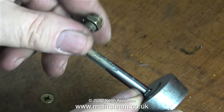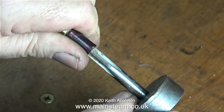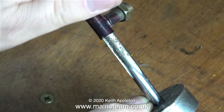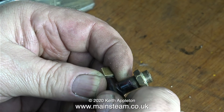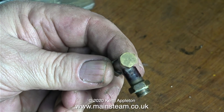This clip is out of sequence. Before I drop the parts into the cellulose thinners in the tub, I've re-threaded the top fitting. The original top cap must have been very shallow because there weren't too many threads down in the hole, which is just as well — it allowed me to thread much further down, and this clip shows that the top blanking plug now fits perfectly.